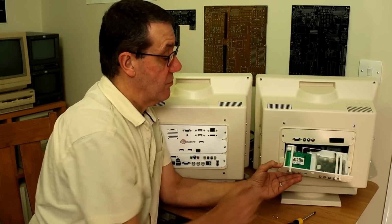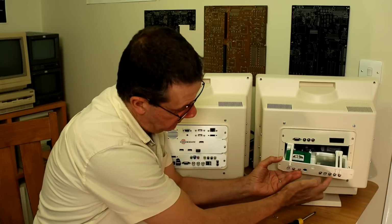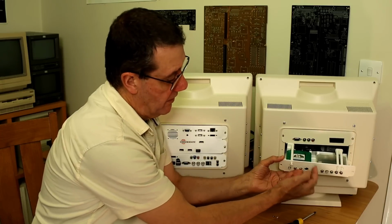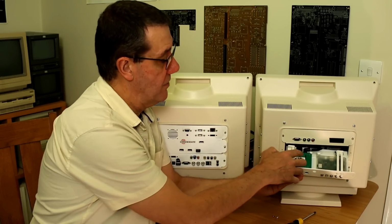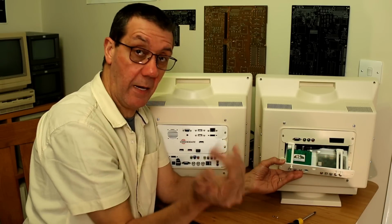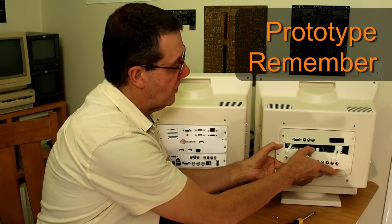Or you can use the Retro Tink Pro, which would have on the side, as you can see, component, audio input, but it's also got Super VHS there on the input side. And that would need to come to the back, and we have a little adapter that's going to go onto the back of it. And then internally all that happens is you plug the HDMI in and the power. There's power connections inside from our breakout board, which give 5 volts into this, powers this, and then it's all neatly locked away, so you haven't got to worry about it.